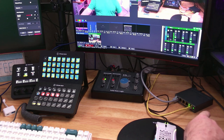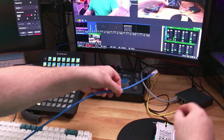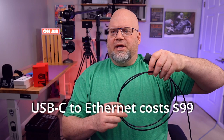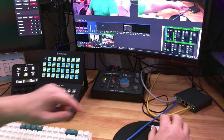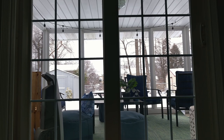We can see the camera over my shoulder now. I have my other camera that's outside the door, and we're going to connect it through Ethernet. I have a little Ethernet switch that is PoE — Power over Ethernet — which means it will give power to the camera and also data. So we're going to plug that in, then install the adapter on the backside, plug it in, and we should have connectivity. I just plugged the camera in, we got great connectivity — it's blinking like crazy — and it pulled up this image.